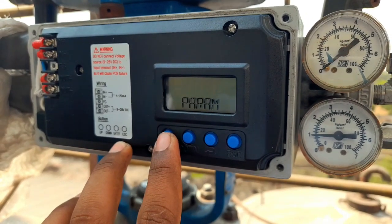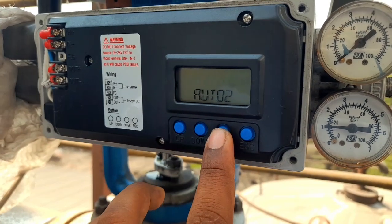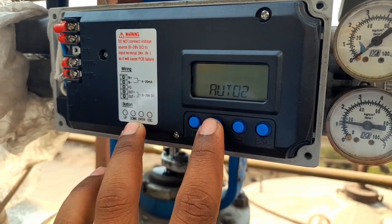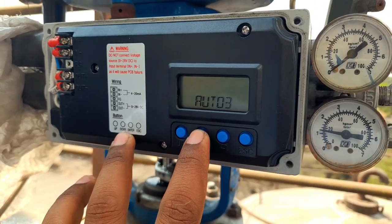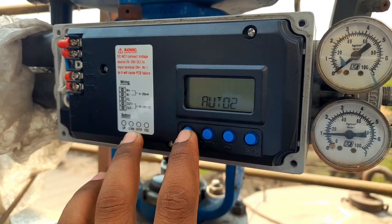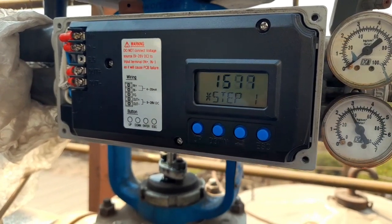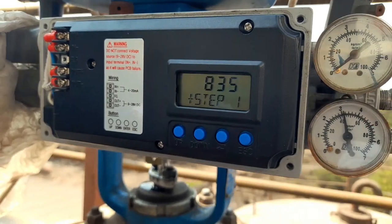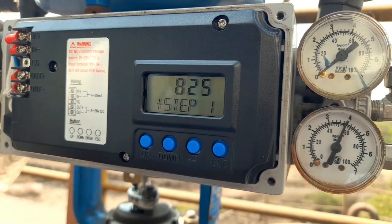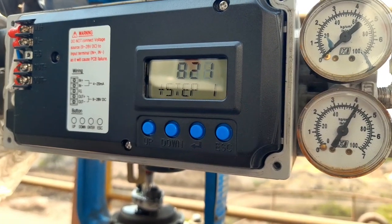And there is Calibration Parameters. You have to press on Auto Cal, and here you can see Auto 1, Auto 2, Auto 3, and Auto HF — these are the auto calibration steps. Now I will go through Auto 2. Just enter it and it will start. It will take a few steps to complete the total auto calibration.